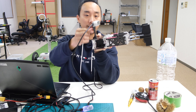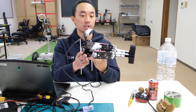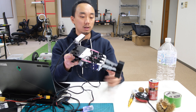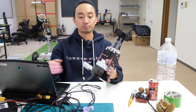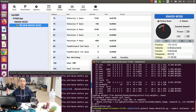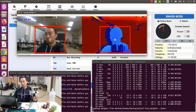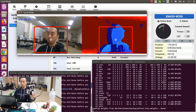I also printed a camera bracket for the RealSense D435 so I can show object detection from this camera. The RealSense camera gives us depth information of detected objects, so we can control the robot arm to grab more precisely. Let me show you the object detection. I'm running human detection which will detect me and provide a depth image as well. From the D435 camera we can know how much depth the gripper or robot arm should travel.